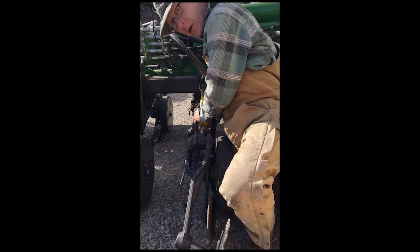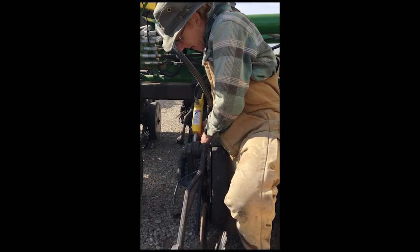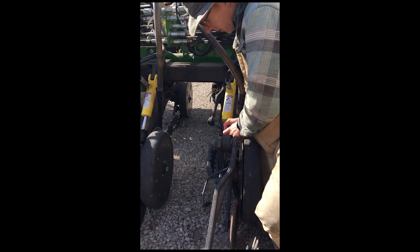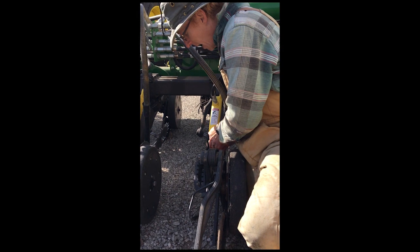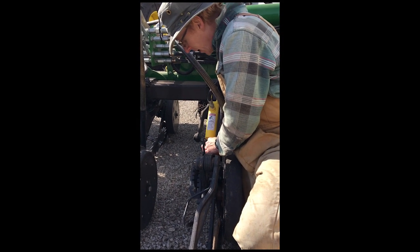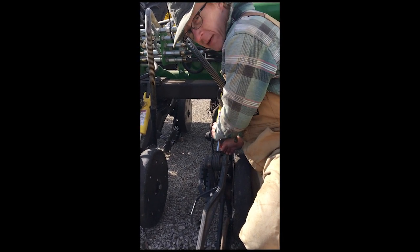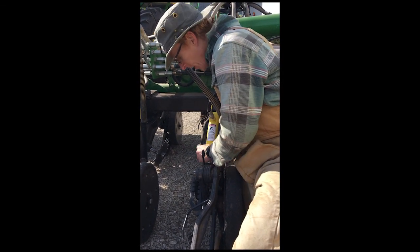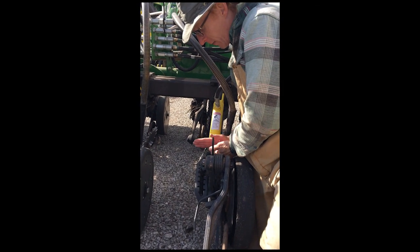You simply remove the OEM spring and the mechanism that holds it. This goes into place with the original pin, and we've got a special bushing system that holds it in place on the bottom. This bushing has a contoured face, so that as this whole thing moves through the field, there'll be a rocking movement here, and this allows the cylinder rod to never have any stress on it. That does a great deal for the longevity of the packing rings around this rod. Our cylinders have extra packing rings and are made with a very high density rod for great longevity. There's a tab washer here on the bottom that holds this bushing piece so that it's always in the correct position for this rocking to occur.